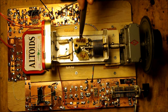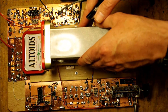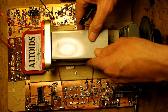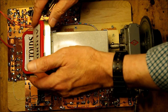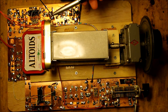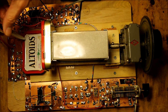Everything is nailed down, glued down, and secure. There's a lot of clear nail polish varnish on the coil. This hood is mostly for temperature stability — it keeps the breezes and temperature changes in the shack from affecting the coil. Most of the circuitry for the oscillator is in this Altoids tin. I've even kept the zener diode and the dropping resistor outside the box to keep the heat outside.